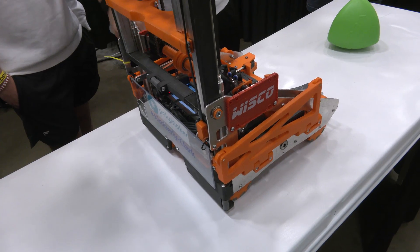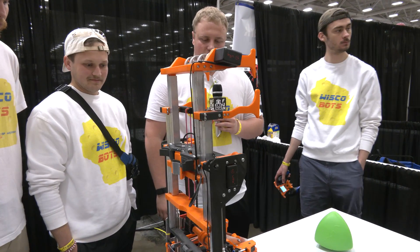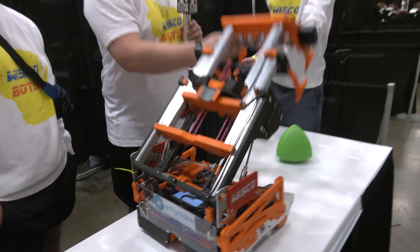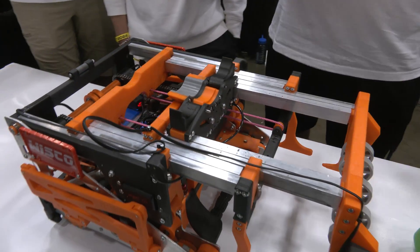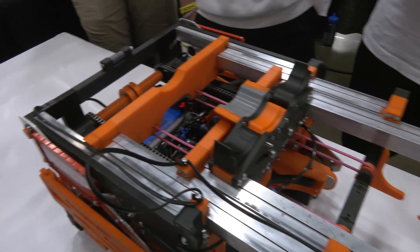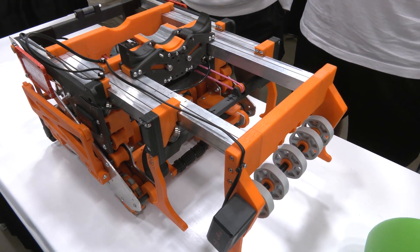How much does this robot weigh overall? This robot is pushing around 28 to 30 pounds. As for determining the number of stages on the slides: since we have the 36-inch radius from the edge of the robot, the elevator goes out about 15 inches, and corner to corner we're pushing about 34 inches. If we added more stages, we'd exceed the building rules, so that determines our limit.